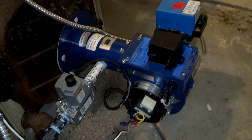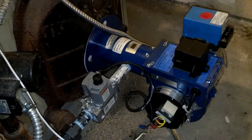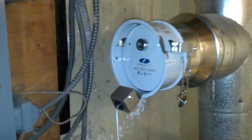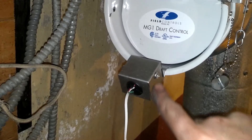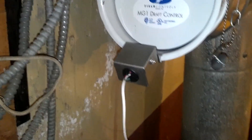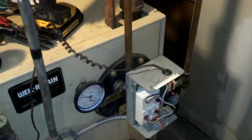One thing you have to do — there's not too much information on wiring these burners up — but in the case you have a boiler with a domestic coil on it, one of the requirements for putting in one of these conversion burners is you have to have the dual-acting barometric damper and also the rollout switch, which is just a 24-volt rollout switch. So with that, you can't just wire it into the thermostat to the aquastat, because it would still turn the burner on if there wasn't a call for heat and it was calling for hot water.